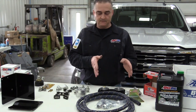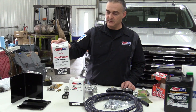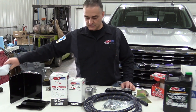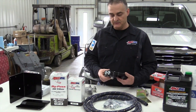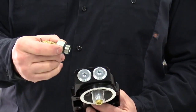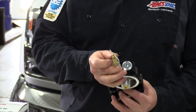The other thing that does not come with this kit is going to be the filters. There's a full flow filter you would have to buy — the EAO26 — and an AMSOIL EABP100, which is the bypass element. You're going to have to buy those two along with it. I also include an oil sample valve. That oil sample valve is going to go in on the plug here from the oil coming from the engine. I'll send along the adapter, the valve, and a cap to keep dirt and water out of the valve. It makes it really easy to take an oil sample to monitor how everything's going.